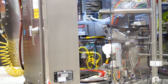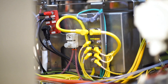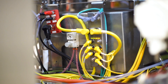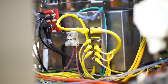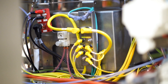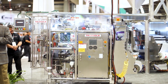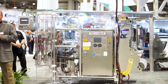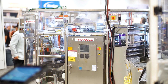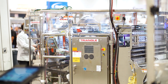The best way to do that is to take stuff that was in the control box and get it out. We identified IO-Link with Balluff as a way to get a lot of the cables — about 20 cables — not going into the control box, whereas they would have had to with our incumbent design. That allowed us to tuck the control box inside the machine, saving about 15 inches in the footprint for our producers, which really adds up when you're thinking about floor space for somebody who needs to have eight machines running salad.